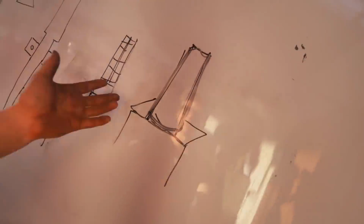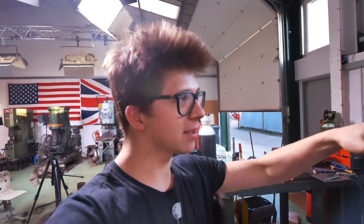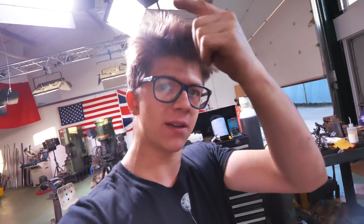So I've been thinking here, and I've drawn up, I mean obviously that's not much of a drawing, but essentially what I'm after is a very slight taper. Some grooves cut in the taper, along the length of the taper, all the way around, and I need a rectangular hole running at least as far down it as possible. I can file and chisel out a decent amount of it, but I need it to at least be started, hopefully on the mill. So I'm trying to work out how I'm gonna organize my steps.